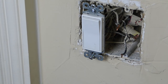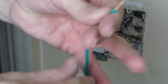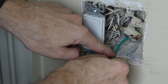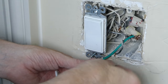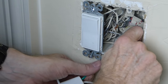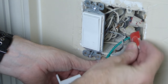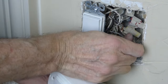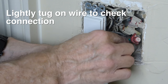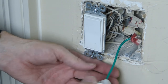There's a little solder on the end of this wire that makes it a little hard to get the insulation off. Now I've got that stripped. I can easily wrap this wire around the ground, which I'll do first. You always want to wrap this wire clockwise so that when you screw on the wire nut, it goes in the direction you're threading on. You always want to pull on the wire to make sure it's secured in that wire nut and make sure it won't come out.